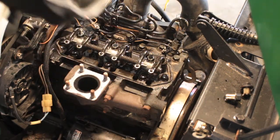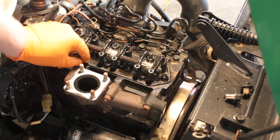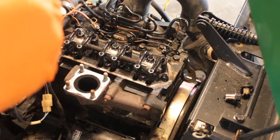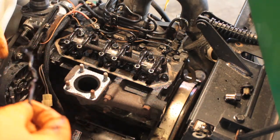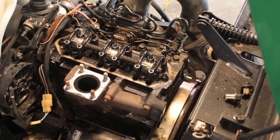I don't think it was going to come off regardless of what I did. So the valve cover is now off and we can see the valves. I would agree that it probably needed a new valve cover gasket — it looks like it's been pretty flattened over on this one side just over time. So I'm going to go ahead and get all this cleaned up, get the new valve cover gasket out, and I need to go get my technical manual. With the technical manual we'll go ahead and see what the valve lash needs to be and go from there.